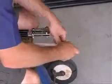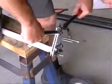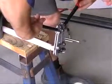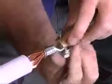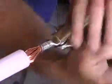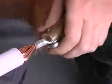Using the crimp lug supplied, crimp the inner copper conductors in the lug using a suitable compression or mechanical crimping tool. Connect the crimp lug to the terminal base assembly using the bolt and washers supplied with the assembly. Ensure that the connection is aligned correctly and tightly secured using a 14 millimeter spanner or shifter.